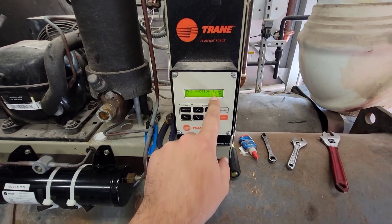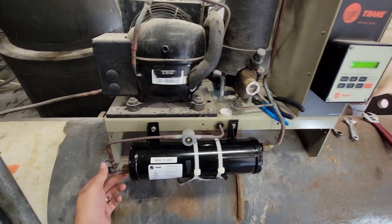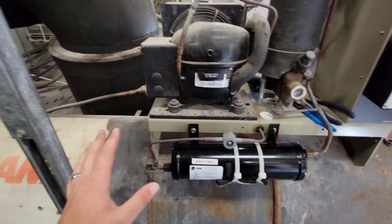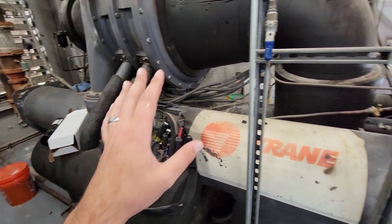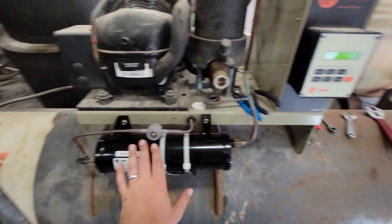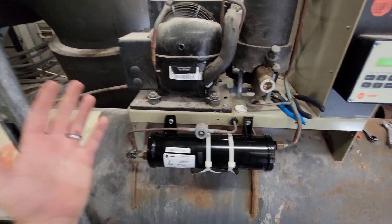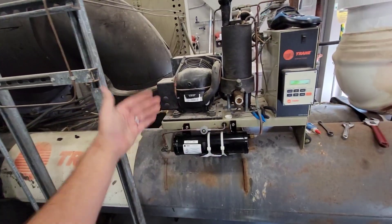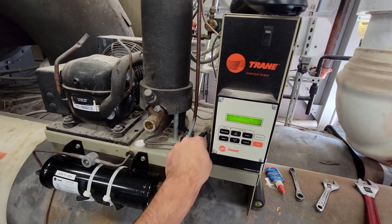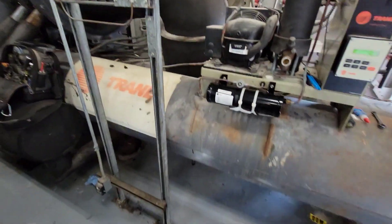We are running a negative two degree suction, which does mean we've got a decent amount of atmosphere that it is trying to pull. This filter needed to be changed - we've done a lot of repairs recently and had this system online pretty steady. Regardless, we're going to attempt a startup on it and we'll see how it goes. If there's too much atmosphere still in the system, we're going to see the system struggle - at minimum you might see what a surge looks like.